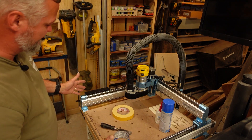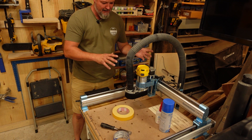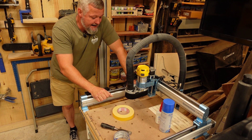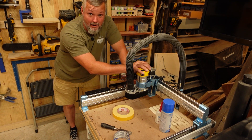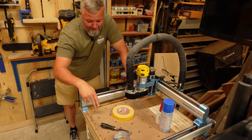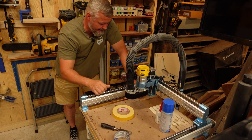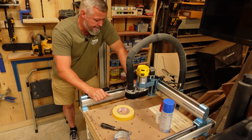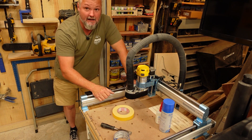Let's go over to the project. I've talked enough about the machine. No issues — people have said I was going to have some flexing when running the machine because of the bigger router and small machine, but I haven't seen it. I ran the speeds pretty high today. I will say if you run the bit down far enough — I accidentally did that because it's kind of like driving a boat; you have to release the button a little early before you want it to stop because the gears still continue to push it. I pushed really hard and it did move up just a little, but it was very, very minimal. So far it's been real rigid. I haven't had the nerve to try out the fourth axis yet — I'm working my way up to that — but that is an option in the future.